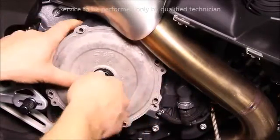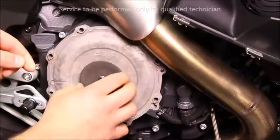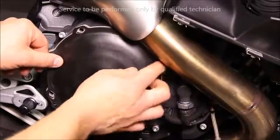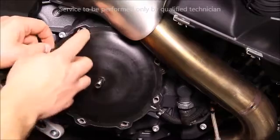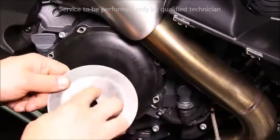Pull the release pin outboard. Next, install the small diaphragm washer. Be sure the word 'out' faces towards you. Then install the diaphragm, aligning it with the pins.